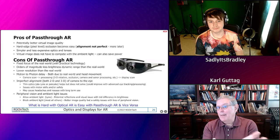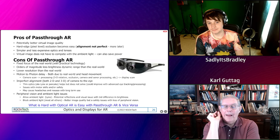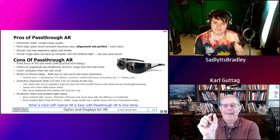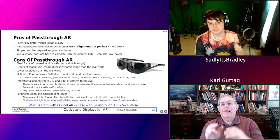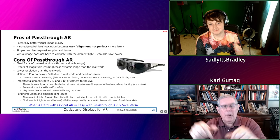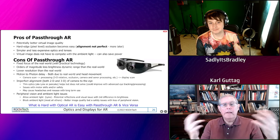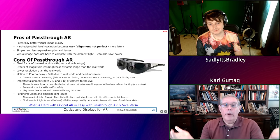In the case of the Magic Leap 2, their blocking pixels are about 100 pixels on a side. A blocking pixel is about 100 times bigger than the pixels in the display. There's no precision — it's an out-of-focus blur. When you turn just one of those on, you won't hardly know what happened. You have to turn a bunch of those on to start blocking light, so it's a very imprecise instrument. When they do it, you see a dark halo around the thing, because in order to block the light, you also block out light you don't want to block — it's so imprecise. That's why they call it soft-edge occlusion.